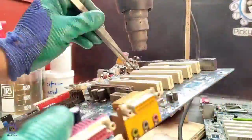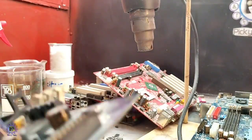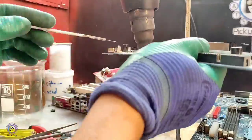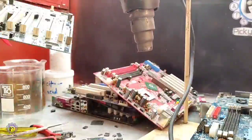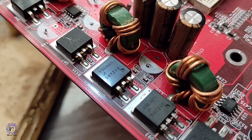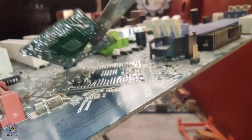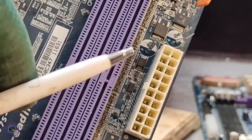To start processing motherboards, BGA chips, transistors, and all IC chips on the board have been separated using a heat gun. You should be careful about capacitors on the board that may explode after exposure to heat, so it's a good idea to separate and cut them first. Also, these ceramic capacitors may contain some silver or even palladium, so it's good to separate them first.